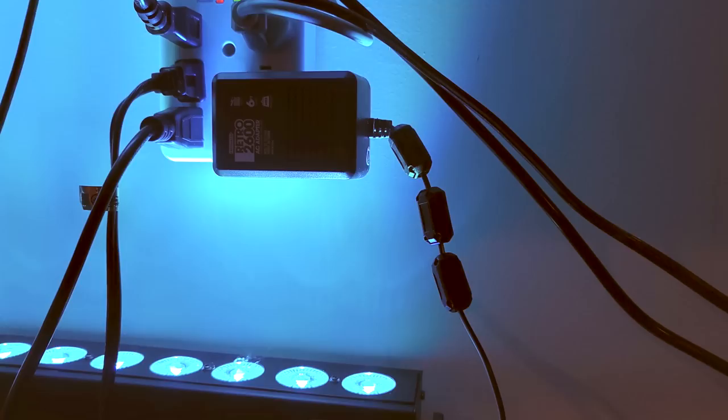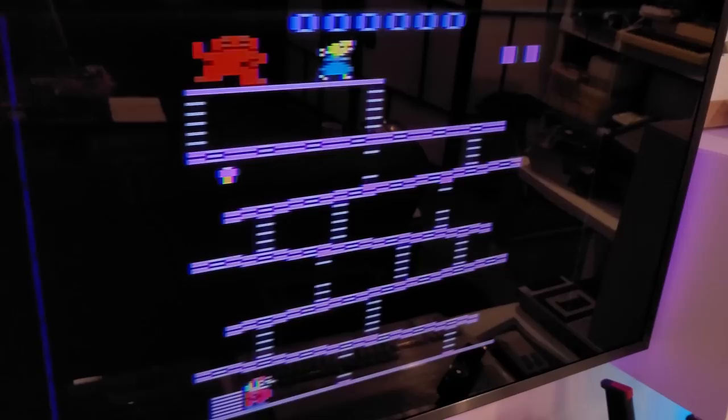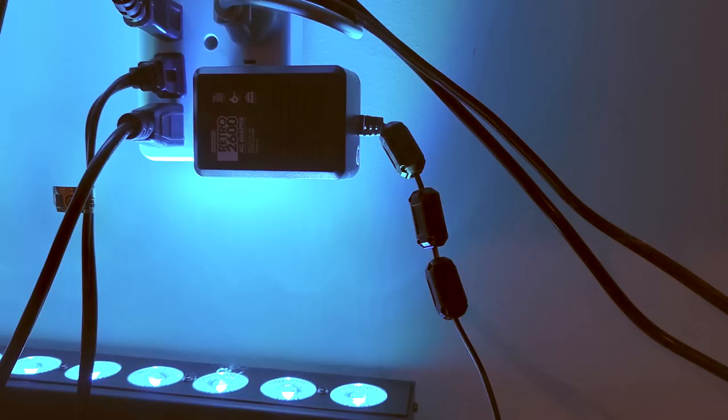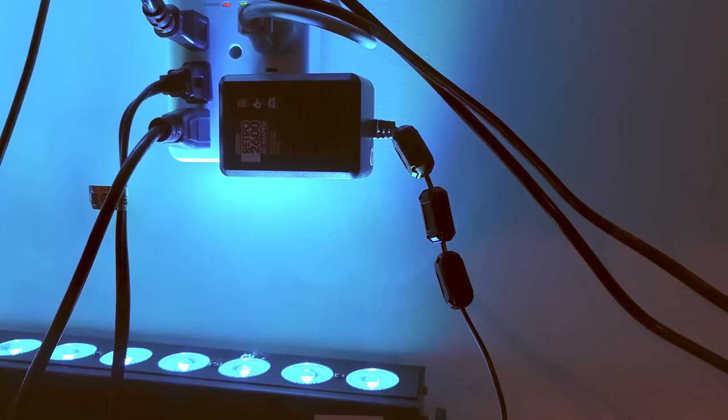So knowing that it is mains power interference, I've added these three ferrite cores to the mains power wire, and double yay, we are 100% complete. You see, ferrite is a ceramic type material that has magnetic-like properties that choke interference. Very appropriate for Lord Vader.